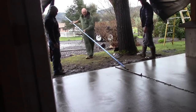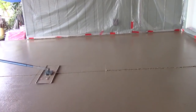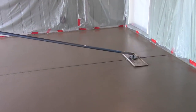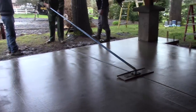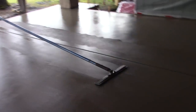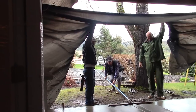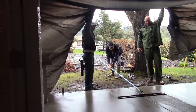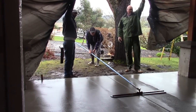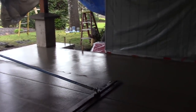This brings up the advantage of using a concrete pump. A concrete pump gets it in place. You don't break any sewer lines or tear the eaves off of any houses or bend any rebar or knock any forms out of line with a truck by pouring, as often happens when you pour out of the chute. You put the exact amount of mud you need exactly where you need it in short order. And so from my perspective, a pump is almost always money well spent.